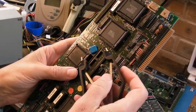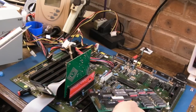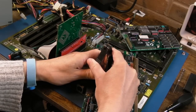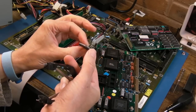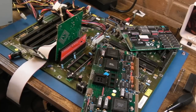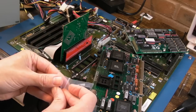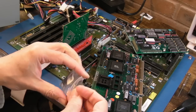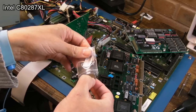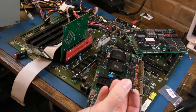We'll try and get this out with the PLCC extractor. They're not the easiest thing to get out, PLCC chips, certainly with this extractor. There we go - I'll just inspect the pins. That looks okay, a bit oxidized on the underside. So we've actually got two things here - we've got a CPU and an FPU. The CPU is a Harris CS80C286-20, copyright Intel 1985. Harris manufactured these under license - they've got up to 20 megahertz. It's not just going to automatically be at 20MHz; we're going to have to change one of the crystals and some jumpers.